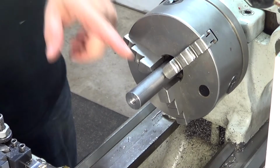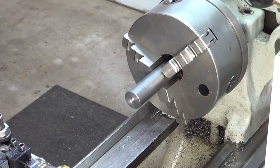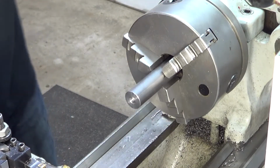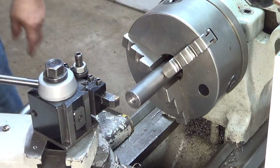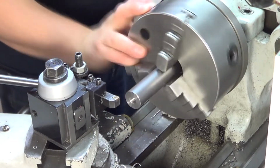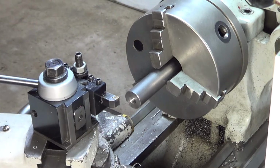Okay, so this is 1-inch stock, and I just remembered I've got to bring it down to 903 thousandths of an inch. So we've got to carve out 97 thousandths out of it over the whole length. And I'm just going to do sort of half and then do the other side. I mean, the external dimensions are just nominal, so we're not talking about anything critical here, right? So let's set up the longitudinal. There we go. All right, that should do the trick. Ready to roll.